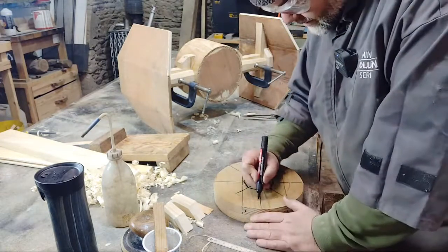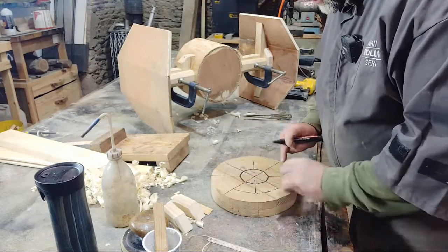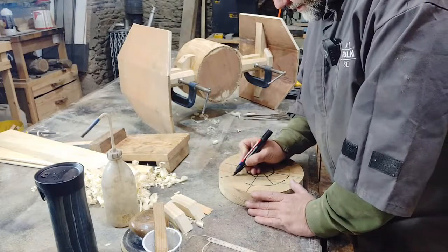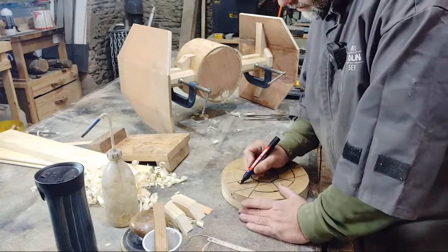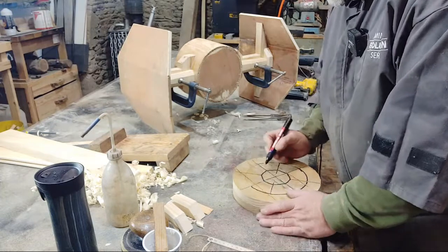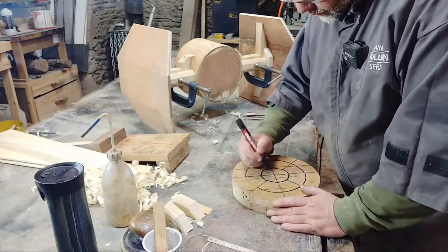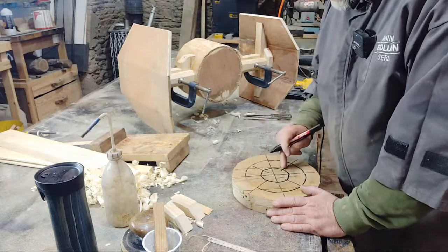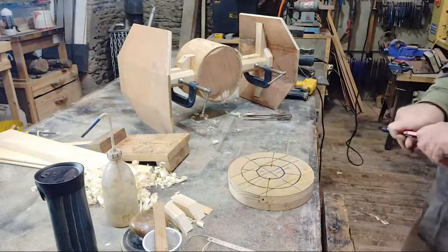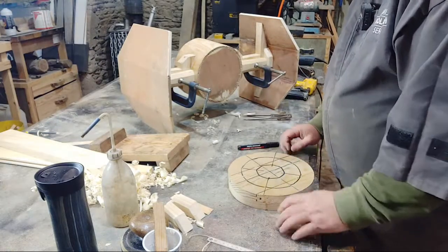Right, so we've got this area. What I'm going to do for the first stage is cut these back, including into these outside edges, then recut the outside bit. I might do it all with the sander really aggressively, or I might do some with a hand plane. I might do both, just go with the flow. I'll take a bit off there, and another bit off there. Now, I'm not going to be taking anything off here, so that'll be my guide. I'll make sure there's a line there. I'm not going to remove any material here, it's going to be everywhere else. But obviously I'd be removing the lines at the same time, so I'll have to keep reapplying the lines, unless I can visually get it straightened out in my head, to make life easier.